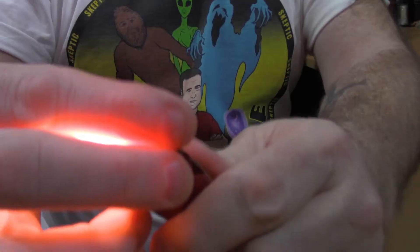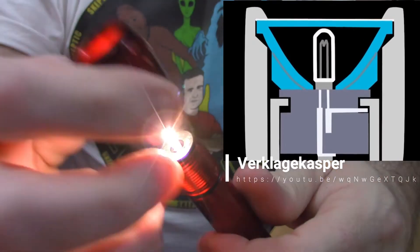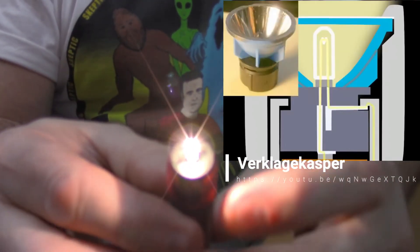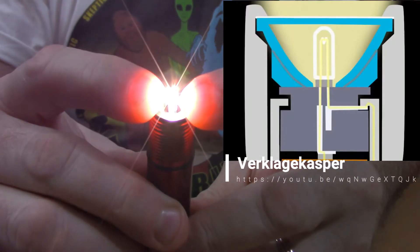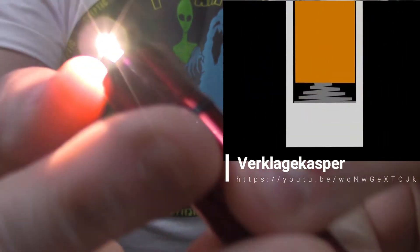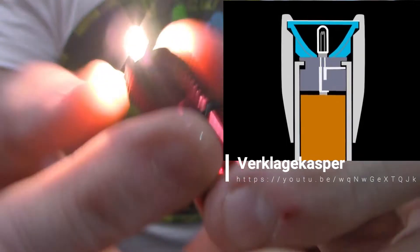Reich supplies a very in-depth explanation, which I'll include in the description below. The basic idea is that the xenon bulb puts out a lot of heat, which causes the reflector — this part here — to expand and get bigger. This supplies pressure to the switch, pushes it down, and breaks the electrical connection, causing the light to go out. As the reflector cools down, it contracts and decreases the pressure on the switch. This allows the electrical connection to re-establish and the light turns back on again. This cycle repeats until the ghost hunters end the session or the batteries die.